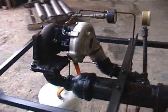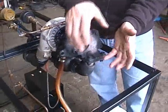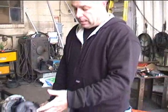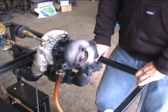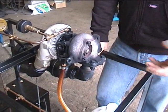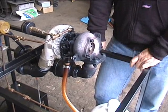The turbine wheel and the compressor wheel are on the same shaft, so any power generated here is used in compressing the inlet air. If we were to use this in an aircraft or for pure thrust, we would have a nozzle on here to maximize the thrust. As it stands, not a lot of thrust comes out, but if we were to make that hole smaller we would get a significant amount of thrust. In other types of aircraft engines, there could be a turbine wheel in the exhaust gas flow where we could get usable shaft output — as in a turboshaft — and they could be used to drive a car's wheels, a transmission, or a boat. Many large turbines are used to drive all kinds of vehicles.